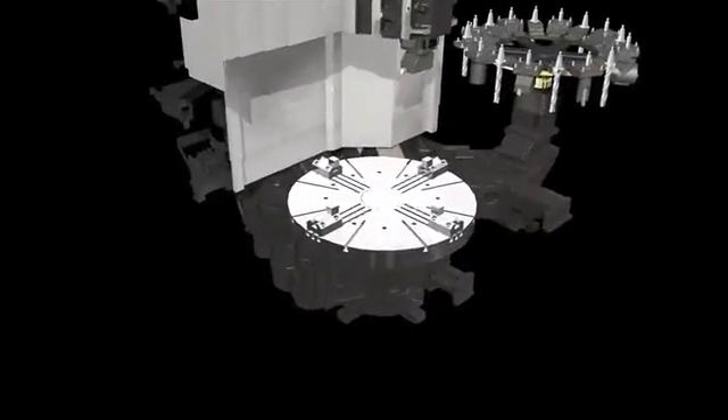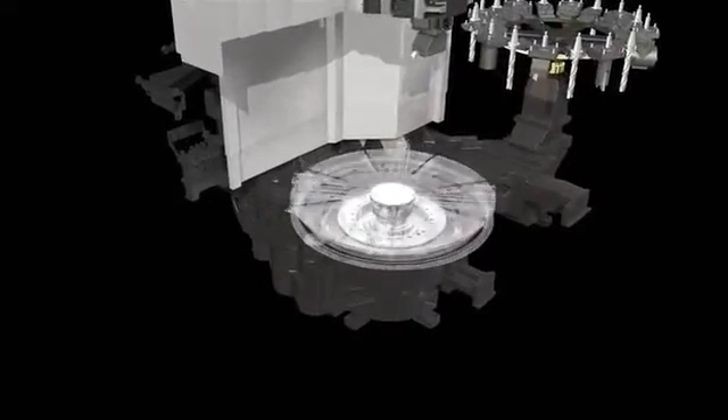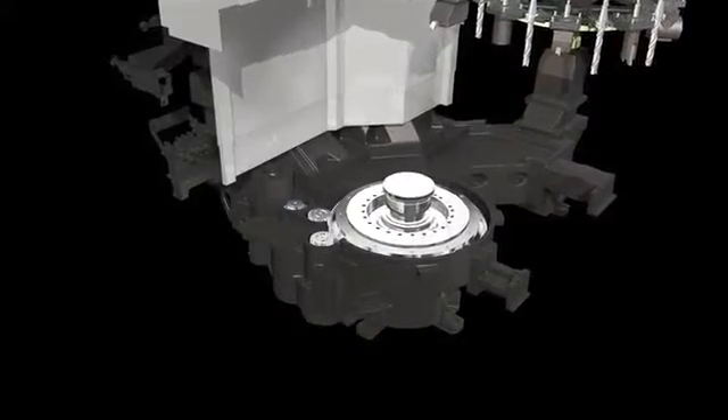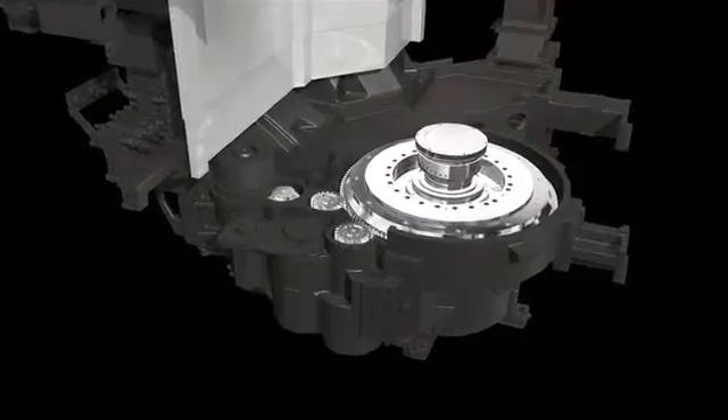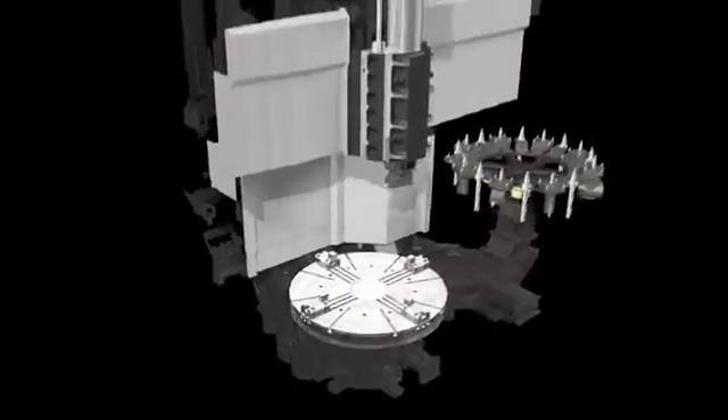The VTS 1620 applies a patented twin helical gear design to eliminate positioning errors from backlash when engaging C-axis control. This design greatly improves machining accuracy and quality when 3-axis machining is required.